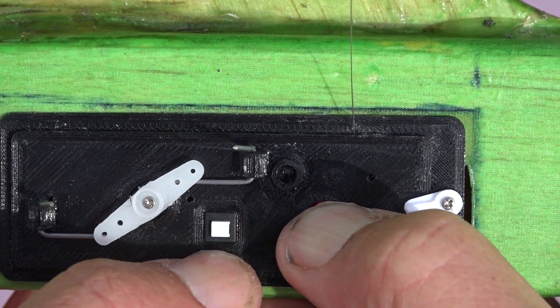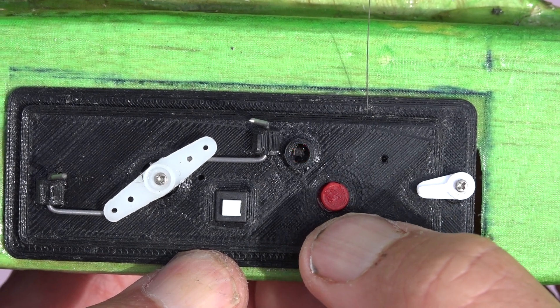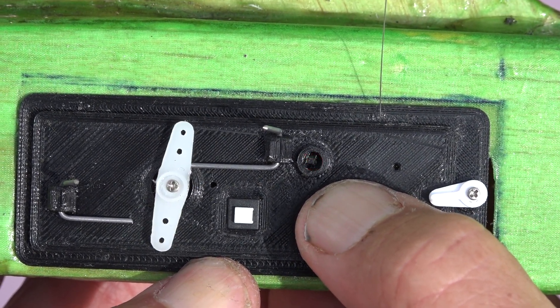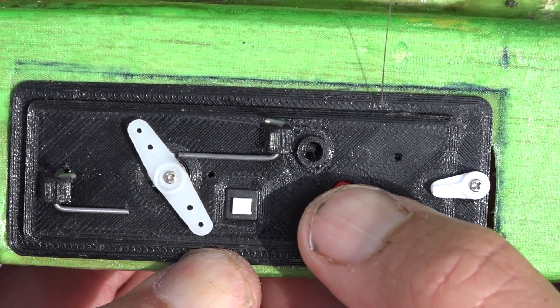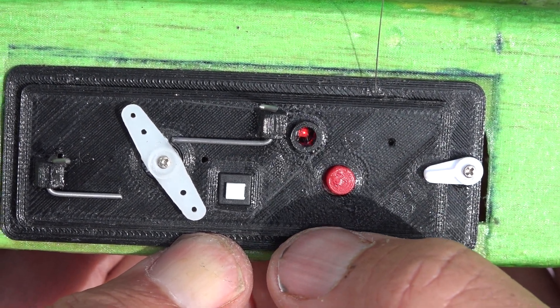This is an example of setting just a ten-second DT. Press, release. Press again to start the servo moving to the right. When it gets to the fifth position, let go. Press again to start the count — just a single flash — let go and it's saved.